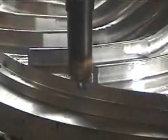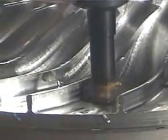That thing is now spinning fast. It doesn't even make a noise. If the surface finish is not up to what we want, we may have to change the inserts and remeasure the tool in order to use new inserts and re-run this program. It's a very short program, but I think we can manage — the inserts are still in very good shape.